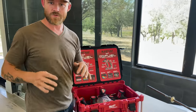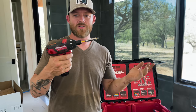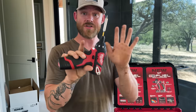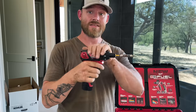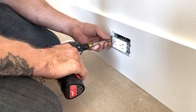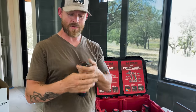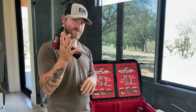Let's talk about the types of drills and when you'd use them. The first is really just an electric screwdriver — we call this a screw gun. There's one setting, no extra speeds. You pull the trigger, you get a speed. I use this M12 just for putting plugs and switches in. It's so lightweight I barely feel it. I can keep it in my tools with no burden. It's quicker than a screwdriver, and it's got a quick-connect that lets you just snap in your bits. I highly recommend this for plugging and switching.